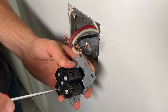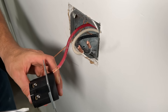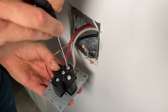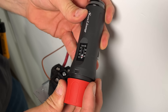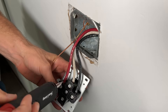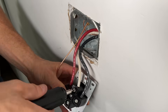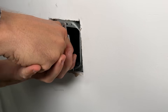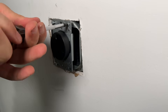First up, I'll get all the wires on each of the individual screw terminals — the top one being your ground. The sides are either one of your hot conductors: red can go on one side, black on the other, or you can switch them around — it does not matter. The neutral goes in the bottom. I'm getting these tightened down and in place, but I'll go back through with the torquing screwdriver to make sure I get 20 inch-pounds. Because these are stranded wires, you want to torque it down until it clicks, then work those wires and move those strands around, then torque it again — do that three to five times before you're confident everything's torqued correctly. Then carefully work the six-gauge back into the box and let the four mounting screws pull the outlet onto the mud ring.